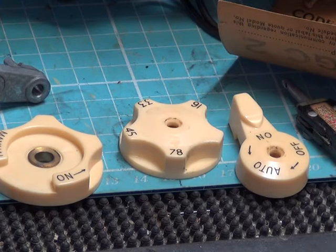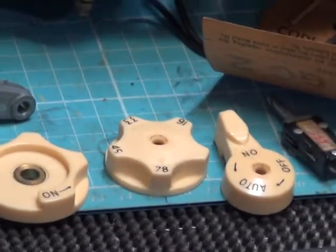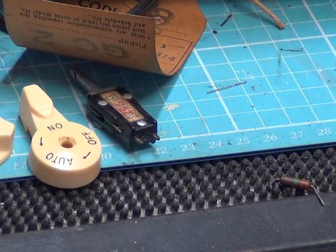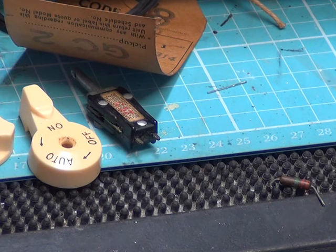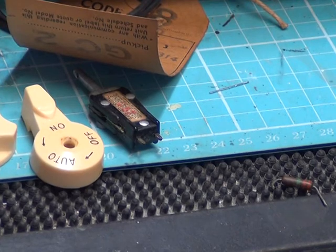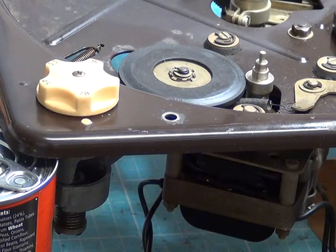The other thing we've got is the cartridge — the GC3 or GC2 — and it could be that there's no output on that, which could be a bit scary. They're crystal cartridges and as you know they fail with age, so we'll keep our fingers crossed. It seems very weird in the way it was performing with the amplifier.